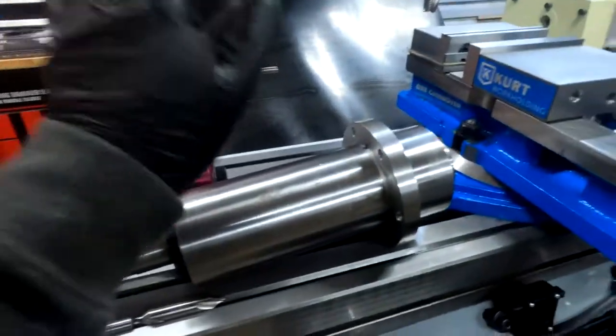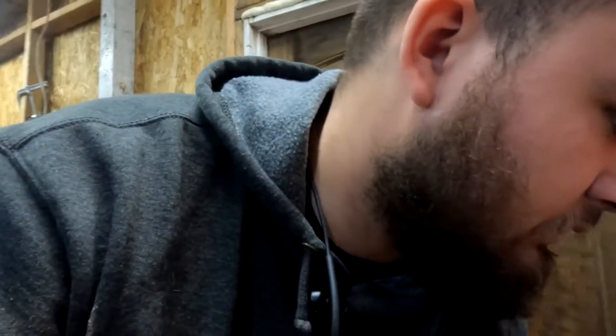This spindle is something more akin to what you would see in a CNC machine for cutting metal — it has an R8 collet system, the same as a general knee mill. What that allows you to do is use any cutter that you want. This is a shoulder mill on an arbor — you can even run that large cutter in this surfacing table. What's nice is they also have — let me show you a drawer of collets.